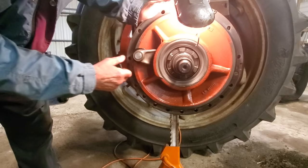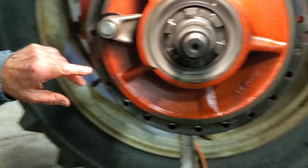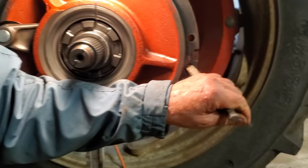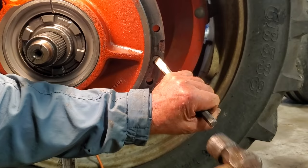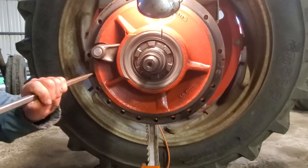To get this plate off, there are two screws here that we have to take out. To get those out, first just to loosen them, I'm going to take a chisel and just start them. Sometimes they will be rusted in and you won't be able to get them started and your screwdriver will slip. So we'll just take the chisel and start them a little bit. Then when you get the screwdriver, you'll be able to unscrew them.